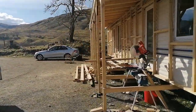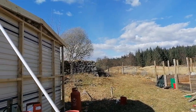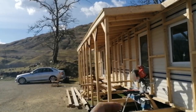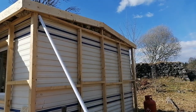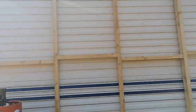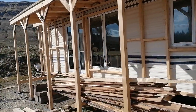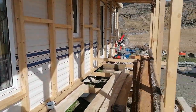I'm currently putting six-by-twos all the way around. I started over on that corner, came around the front, and I've put a drip on — a tube nailed to there — so that when I bring the felt over and down, it'll drip into a gutter. I'll do the same on this side, and up here I'll just bring the flashings over flat onto what is effectively a fascia board. It's all rough timber, but that's fine.